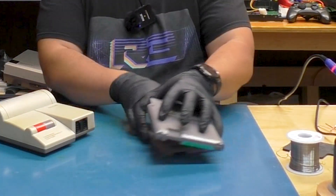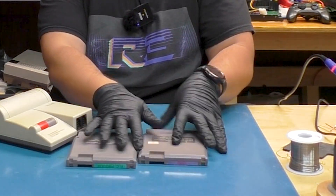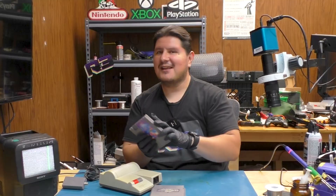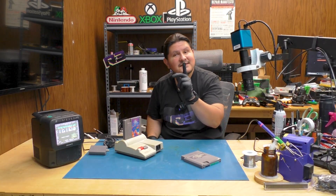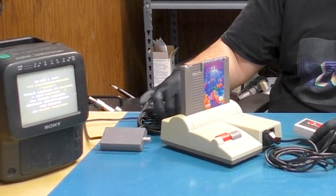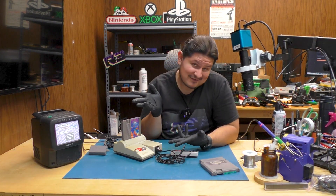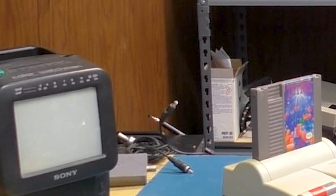We're going to randomly decide which game we are selecting here. This is Tetris, right? It is. I got it right — that means you have to give me a subscribe and a thumbs up. Is it on the wrong channel? Yes. But does sound work? Does the controller port work? Because that's what we're testing as well. Yeah, I'd say the audio works and obviously the picture. Let's go ahead and progress. We're going to save this console from a corrosive death by preemptively replacing the capacitors.